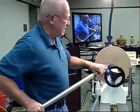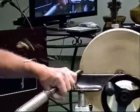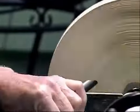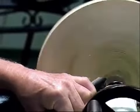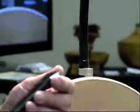We're not going to have a demo here on how to cut. I stand over here, especially on a new piece. This is not a really good place to stand. What is the tool that you're using? This is a 5/8 bowl gouge with a standard, well, wingback grind, standard grind.